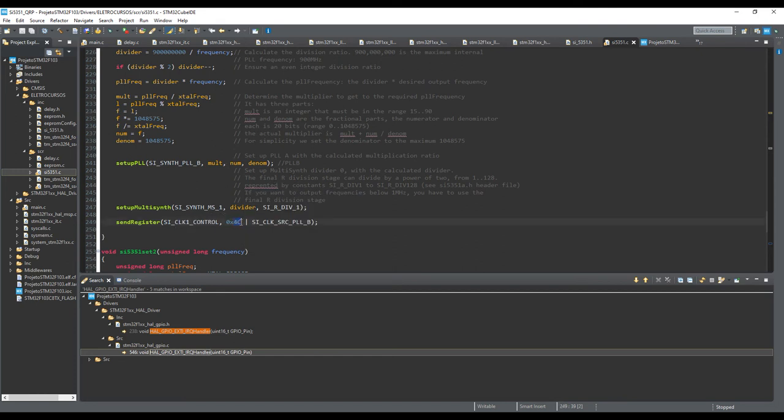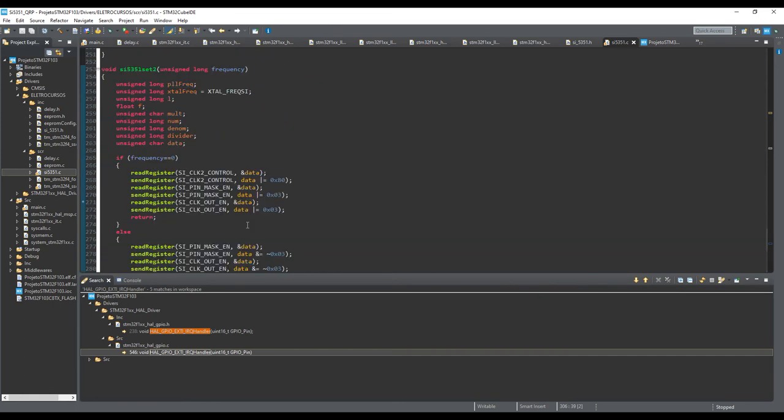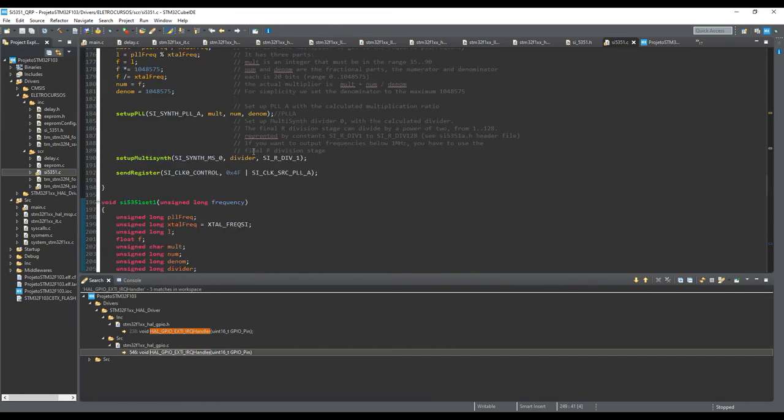More. This is a register. And some information in this register, okay, like this number 4F, if you see here, 4 for F, for C, and for F. If you put the hexadecimal 4F, you want to send 8, I don't remember if 8 or 20 milliamperes, I think it's 8 milliamperes output, I don't remember exactly. So it's the maximum current driving in the output of your DDS, of your clock source.